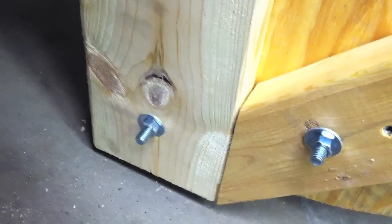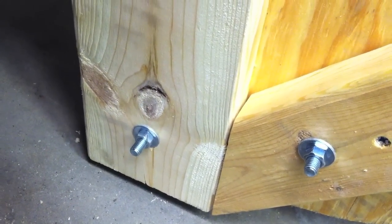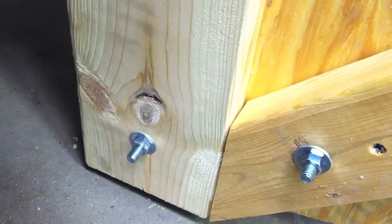It sits there on a 2x6, and the 2x6 is off the ground — the weight is actually transferred to the plywood. It's 5/8-inch plywood, which is probably about the minimum I would go with. This is probably a 600 to 700 pound chassis. If you're doing a bigger car, I'd probably go with an inch-thick plywood or two 5/8-inch sheets, one on each side with the wooden frame in between.